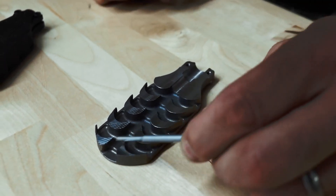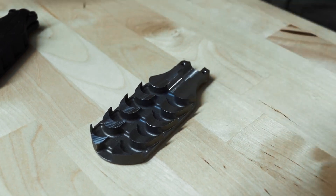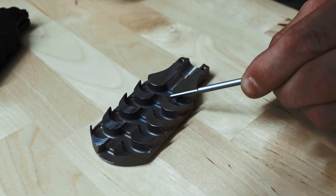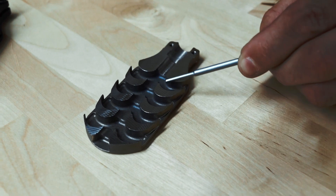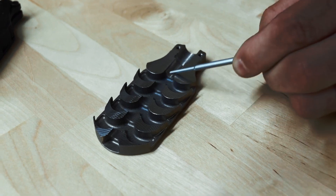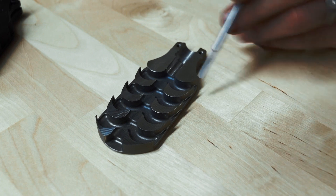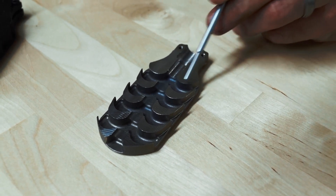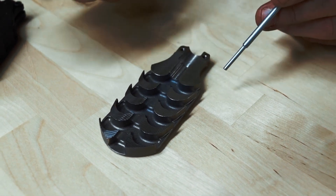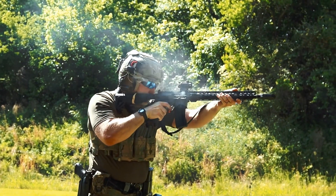The design is that as the gas exits the barrel and the bullet is now traveling into this free open cavity, the gas behind it starts to flow to the path of least resistance. We see these longer arcing radii where the gas can build up and then slow down as it gets caught into these little pockets. The steep inner radius speeds it up, and then the leading edge wants to slow it down and grab the burnt powder gas as it turns into these little chambers.